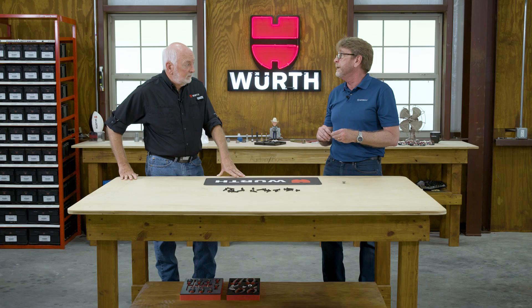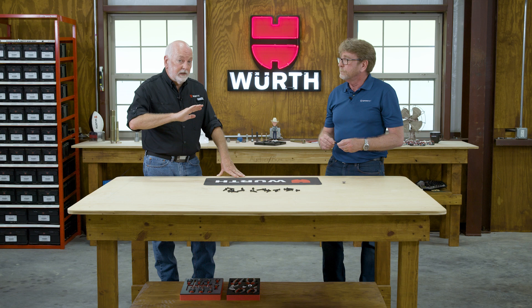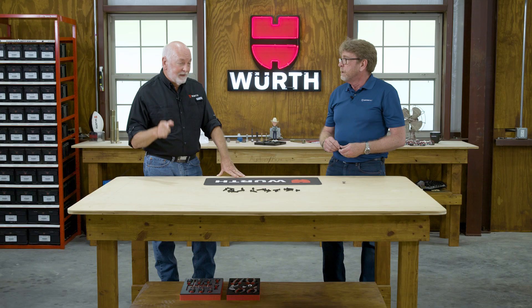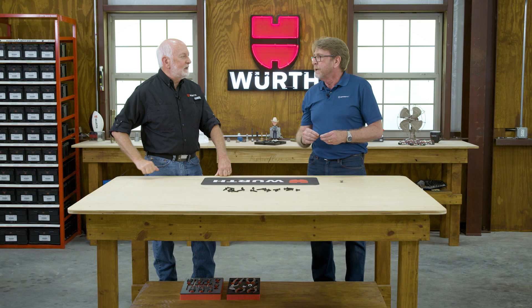We've eliminated the failure mode of fastener stripping or nut member stripping with this design. We have a very unique thread design that helps us eliminate — in standard depths of engagement — the failure mode of stripping. That's a game changer. That changes the entire industry. Now we have a screw that can assemble from one side and do what a bolt does — an incredible cost savings to manufacturers who don't have to have a nut and bolt assembly. It goes all the way to full tensile load, creating full clamp load of a property class 8.8, 10.9, or in the inch series, grade 5 and grade 8.